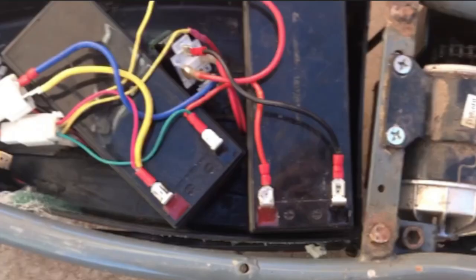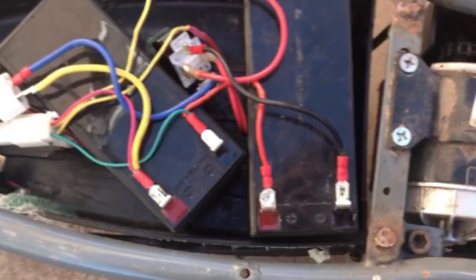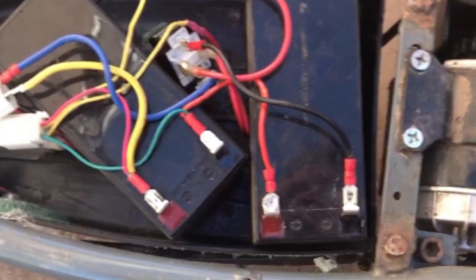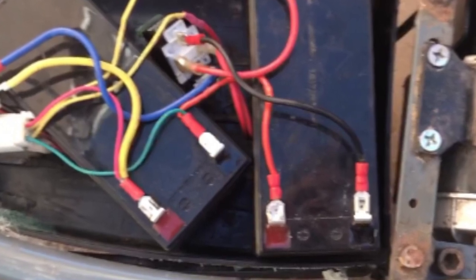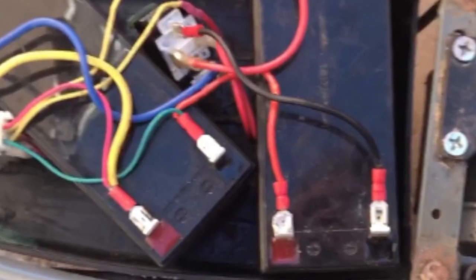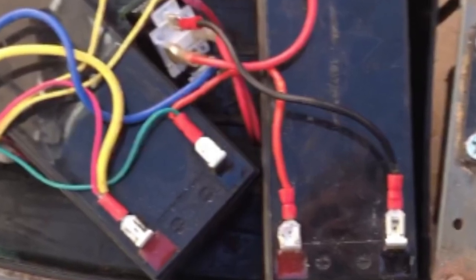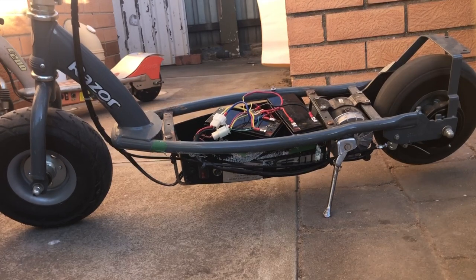As you can see, I have 12 volts coming off of the left battery to the throttle connector. The throttle connector output then goes to the relay pins 85 and 86, which are the activation part of the relay. I then have the shunt of the relay, pins 30 and 87, where I've connected pin 30 directly to the motor, and 87 to the negative of the two batteries in series. I've then connected the positive of the other battery, which will be 24 volts, to the other connection of the motor.